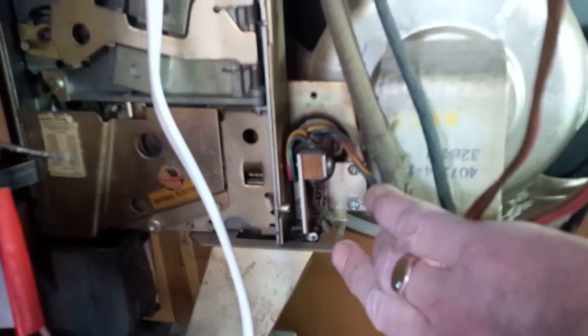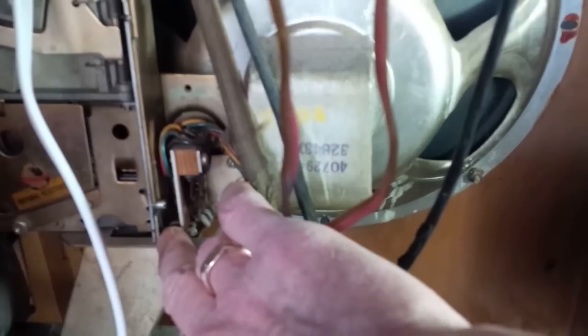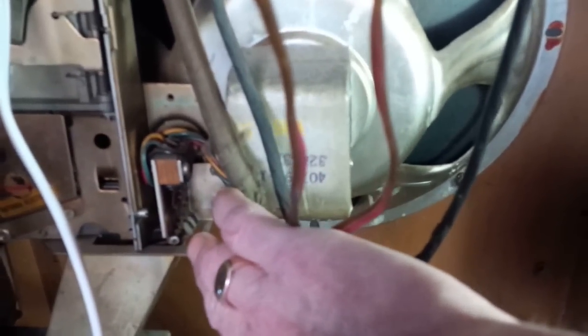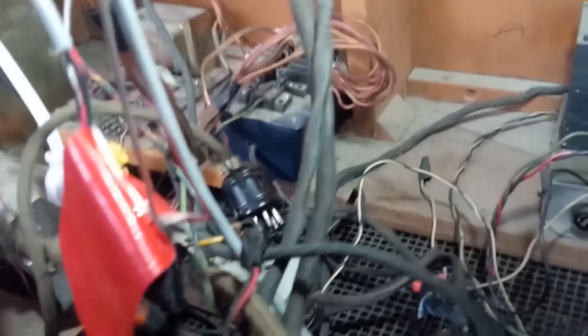And these are the coin switches right here. I don't want to touch them or disturb them. I really want to get in there and get a good close look at them. The coins drop out here, down the slot and into the coin box. And as they do, they strike some levers. When they strike, the levers push these reed switches here. This is the wire that carries the switch. I've never studied these things before, never had any need to. There's a lot to this jukebox, and I just concentrate on what I need to know.